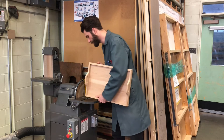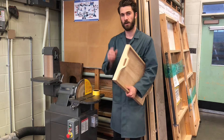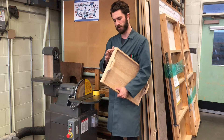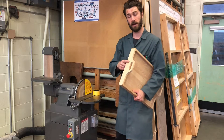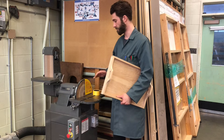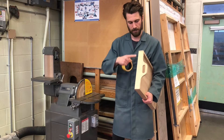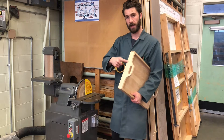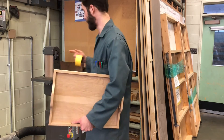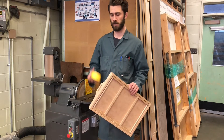We're going to do that by holding the tray vertically and just touching it to the end of the side piece. We're going to do that for most of the material and then finish the last little bit with a block and sandpaper, just so that we don't expose the end piece to the really rough grit, which would take a long time to sand off. To make sure we don't accidentally touch that to our piece, we're going to put a little bit of tape just on the edge beside where our end piece and side piece rabbet meets. I'll put one strip of tape and then sand almost all the way, then finish it off with a block by hand.